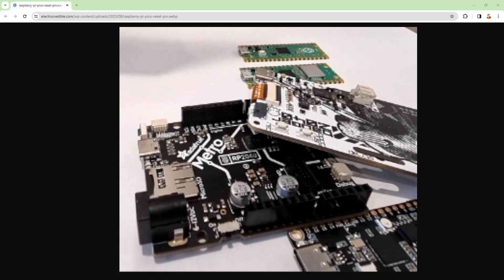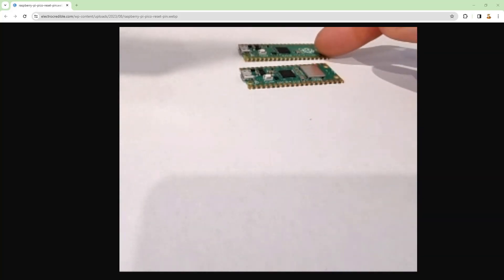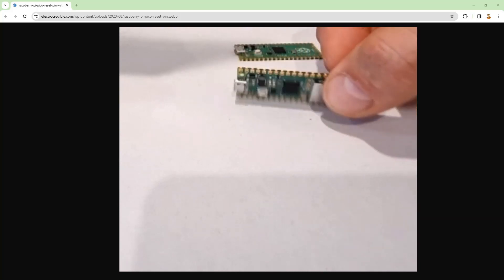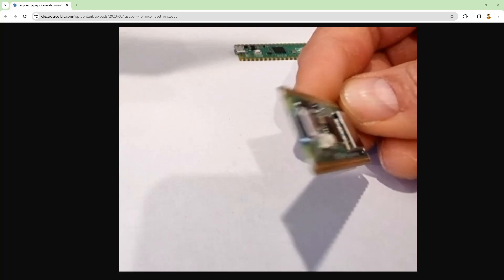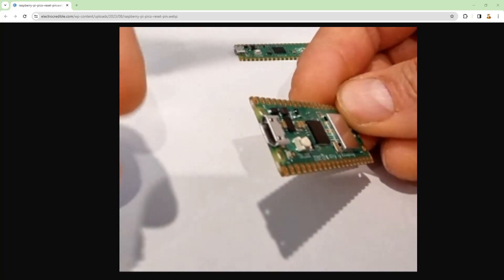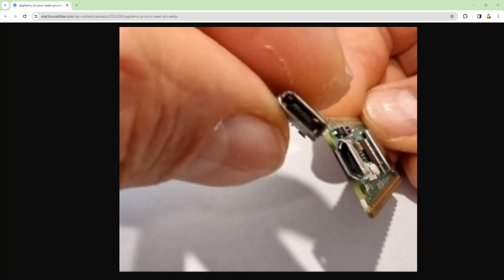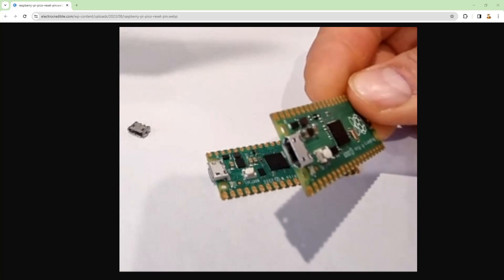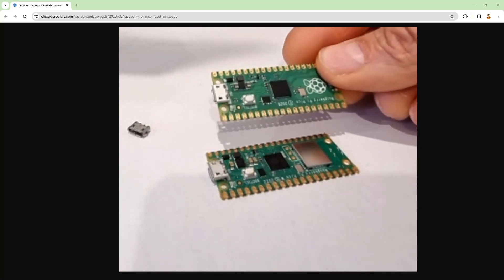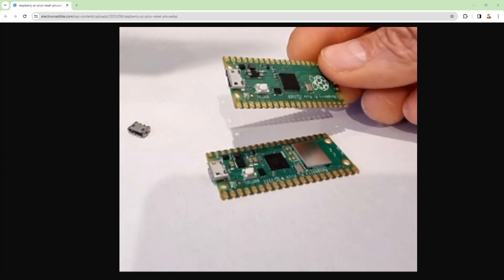I think I'm in a pretty good position to show preference — I'm not sponsored by anybody, so this is just personal opinion. I think the Pi Pico is overdue for an update. Even if they don't redo the Pi Pico, they should do both it and the Pi Pico W. There are two things wrong with this board: the first is that it still doesn't have a USB-C connector. If you use them a lot and keep unplugging and plugging, you end up with a broken connector and a useless board — these micro-USB connectors will eventually break off because they're fragile with tiny little pins and not very well attached. Same is true of the original Pi Pico: still no USB-C, and still no reset button. Without a reset button, you have to unplug and plug it back in to reset it.